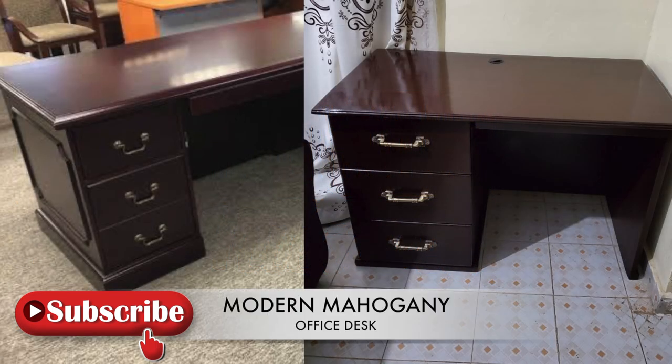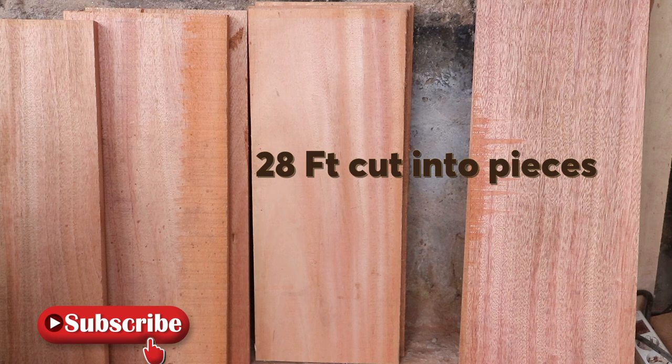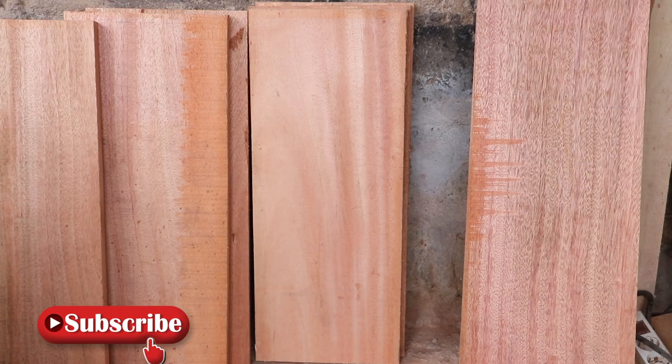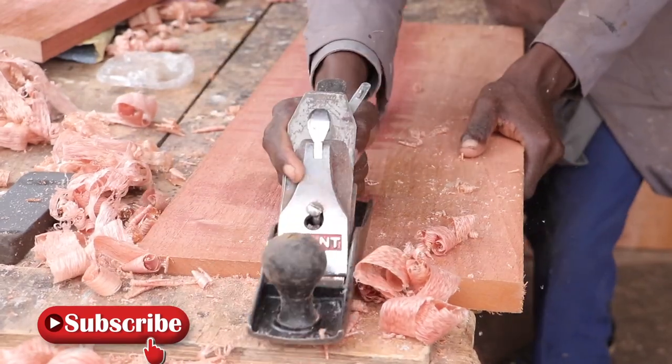On this week's project, we will be creating a mahogany office desk. The project requires a 28 feet 12 by 1 piece of mahogany. From the 28 feet, we cut 4 equal pieces measuring 5 feet and 2 pieces measuring 4 feet. We then planed off each piece to level the surfaces and get rid of high spots.